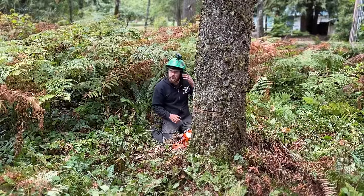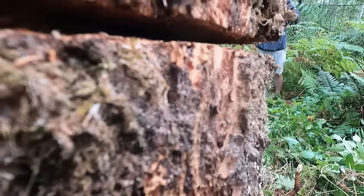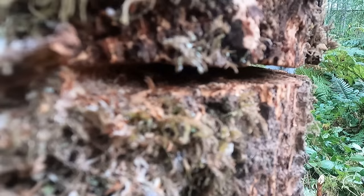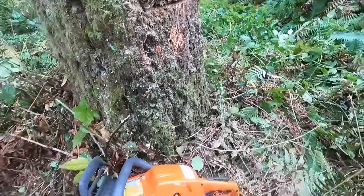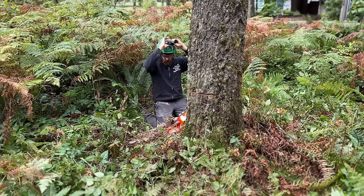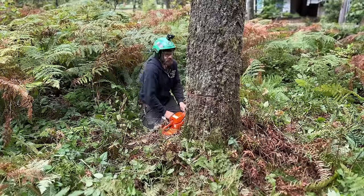Now, when you do your top cut and you want to line it up, if you get down, you can actually see inside the curve here, and this will help you line up so you shoot for that corner. Just look down and take a peek in here. It'll help you line it up. I usually cut Humboldts. I'm going to cut conventional because it's a little easier to cut, I think, for most people.